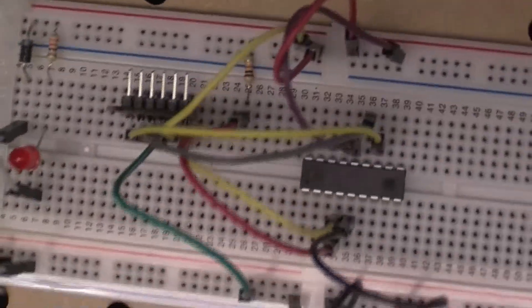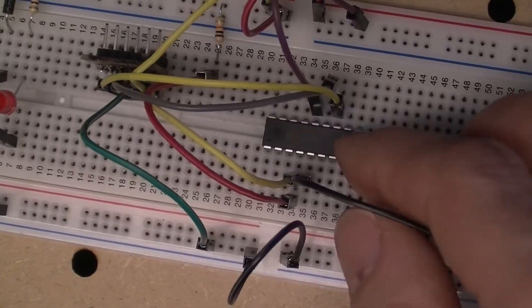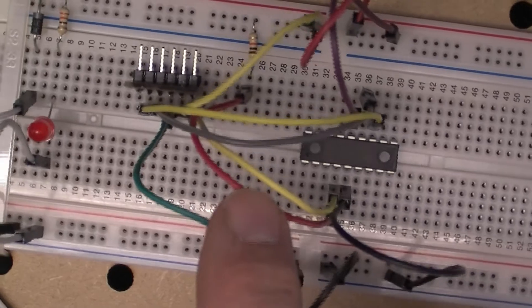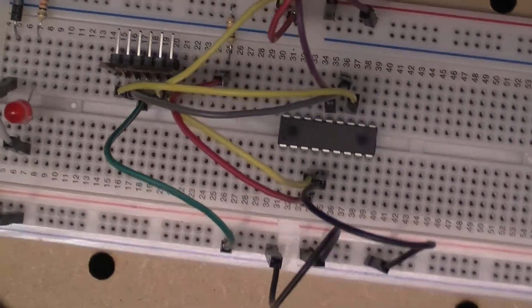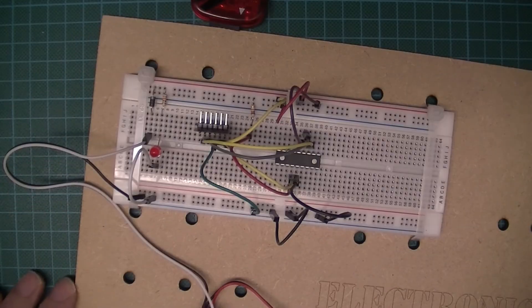So I've got five of those PICkit pins connected: positive power, ground for the PIC, programming clock and data, the pull-up resistor on master clear, and pin 1 of the PICkit to master clear/VPP. That's the complete circuit just for programming.